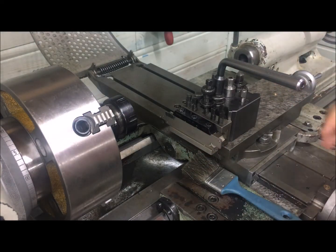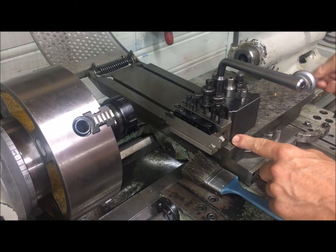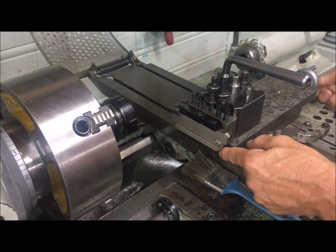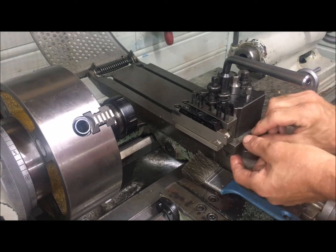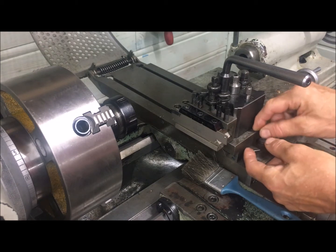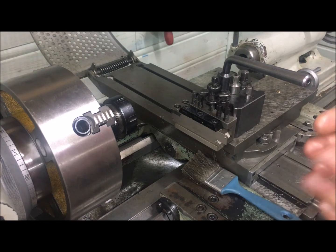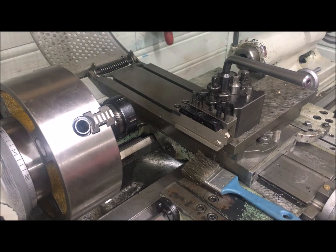In that clamp tool post, but I think I will mount a rigid tool post on there. And as I don't need a compound slide anymore, just use a block like this directly to the cross slide — either one block or another.